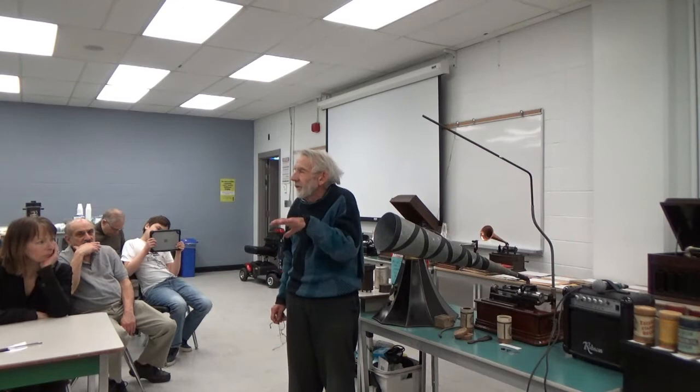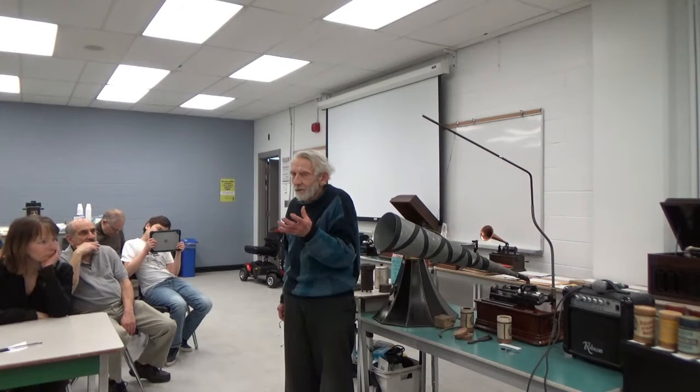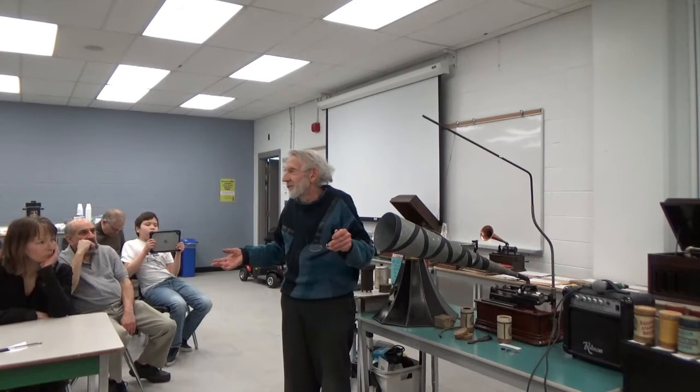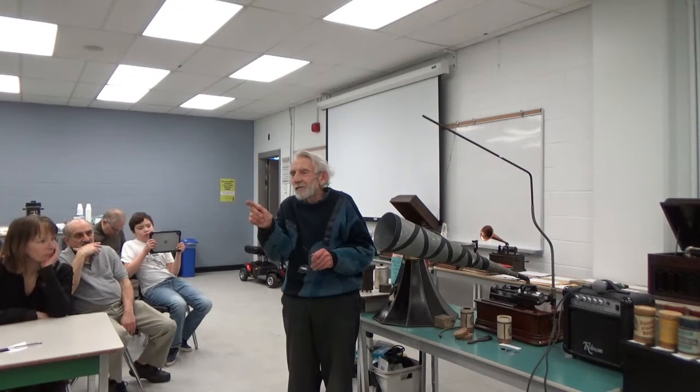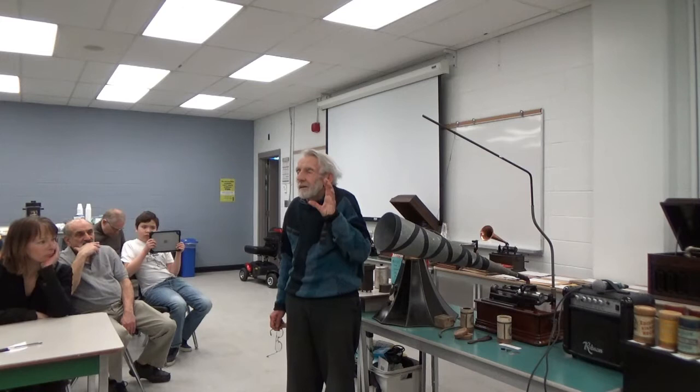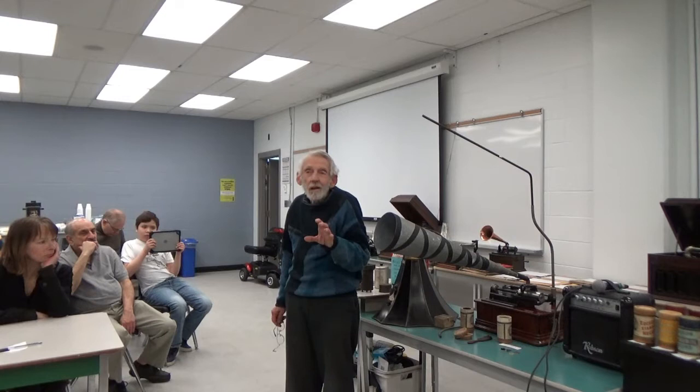And the thing you have to remember when you're using a heat lamp is that you're expanding the cylinder. So that means that you have to make sure the cylinder is tight enough on the mandrel when you're making the record that the cylinder doesn't start working its way off, because then you make a very strange sounding record and the grooves start to get closer and closer together, and eventually your recording is in one place, and that's no good. But anyway, if you're careful about it, you can do it. Take the cylinder off immediately once you've recorded it, because it's going to start to cool down. And just remember about expansion and contraction all the time, and everything will be fine.